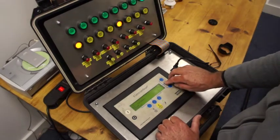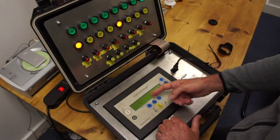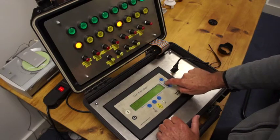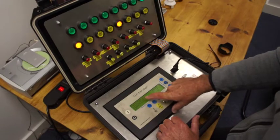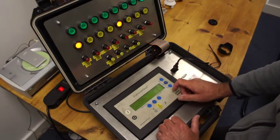This is where we can alter protection, parameters, protections, service plan, menu, etc. The first one we're going to look at is parameters — it's highlighted, press once. We can look at loading pressure and unloading pressure: we've got 6.8 and 7.2, so we want to modify those. Simply press this.